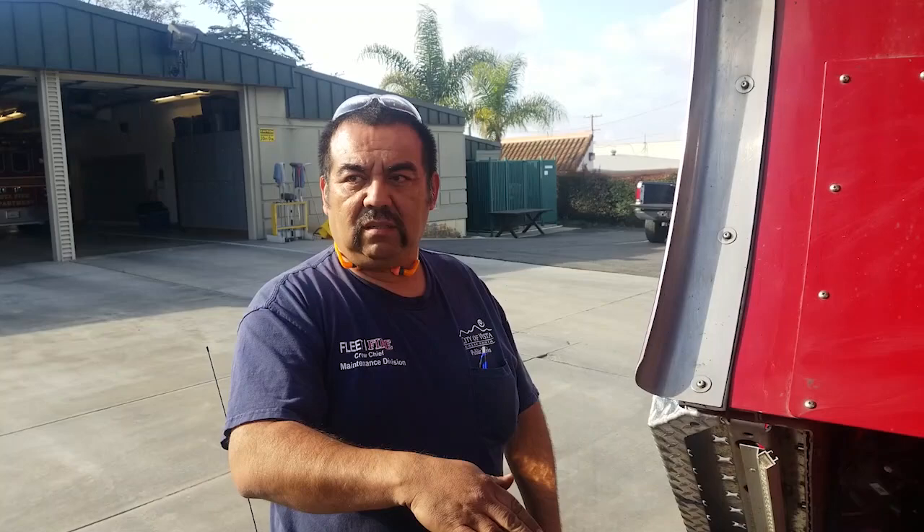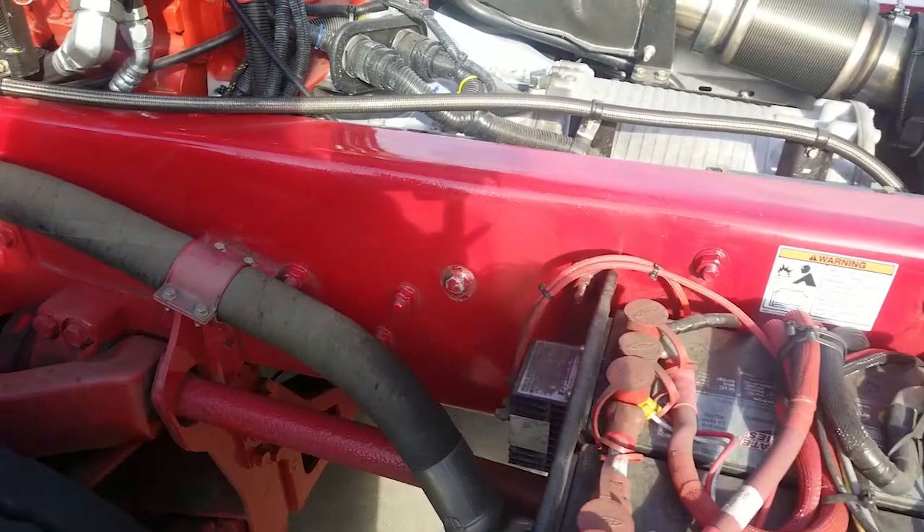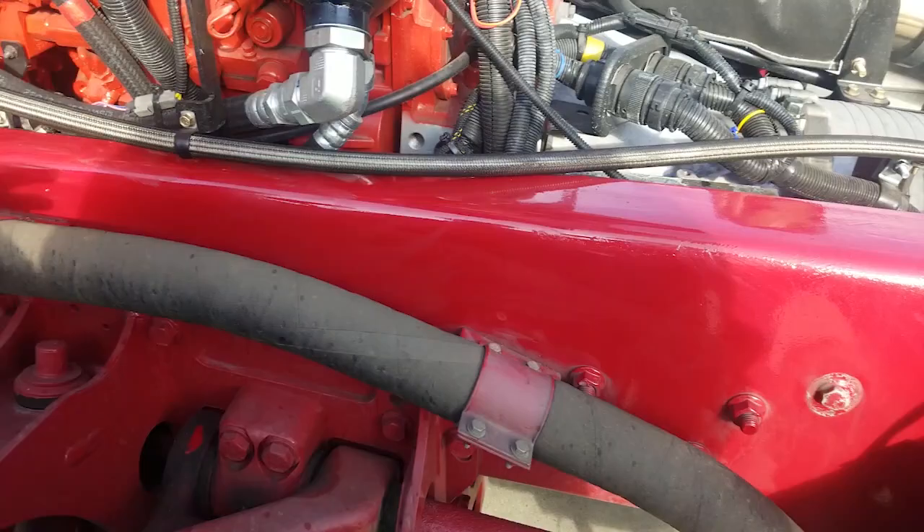Other indicators: put the parking brake on and it just doesn't want to hold — then something is going on. Carry on to the frame — that's why these are painted red, because it's easier to see problems, cracks, the black everything. Look at hangers, bolts, battery mounts — make sure it's all good to go.